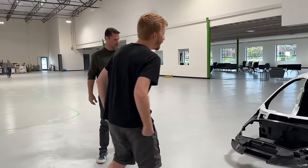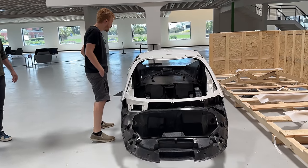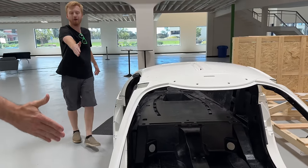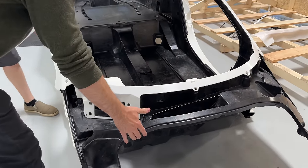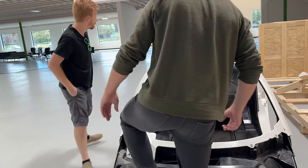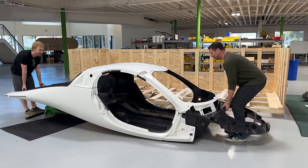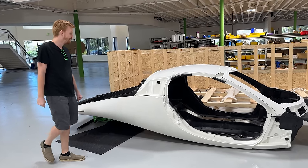And the piece de resistance — the big reveal. Wow, it's roomy in there. What a big piece. From back here all the way to the front — that's one piece. The cowl is separate; the tub ends here and the cowl goes further forward. This is kind of a liner part — go to the tail and lift it up. That's the whole Aptera body structure. Stronger roof crush strength than any passenger car on the road.